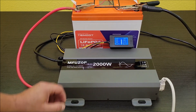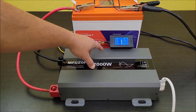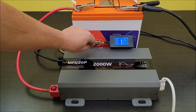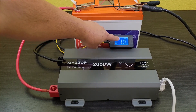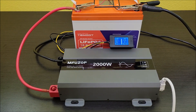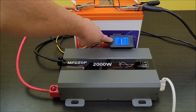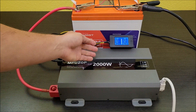It's a little noisy in here right now. I've got the portable AC running, and the fan on this inverter has kicked on because it's over about 20% load, so it automatically kicks on. The app said it was around 22% left in the battery, so I wanted to come and check it — and sure enough, we're at 79.4 amp hours. We're over 1 kilowatt hour, and things are still looking pretty good. I'm expecting this to get to right about 100 amp hours based on the app and how this thing is functioning. It dropped back down — the AC compressor turned off — but before that it was using around 50 to 55 amps. It's kicking on and off, but so far so good. The load test is going well.